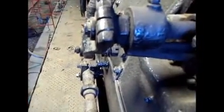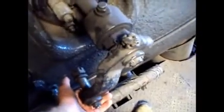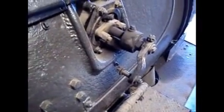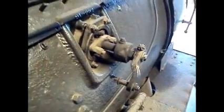Anyway, coming up here now, we got the throttle valve, and someone had this open. I found it one week, and I was kind of mad because everything is supposed to be kept shut. It was pushed forward. I had to pull it back. Make sure it's a little bit loose right now. It should be back as far as it can go. Make sure those valves are shut because it's not supposed to be opened until it's under steam or some other type of pressure, to make sure it's sealed and shut off. Like I said, there's no bar across yet to the throttle. So the fact that someone was up here and must have grabbed it to hold on or something and opened it, that's a no-no.